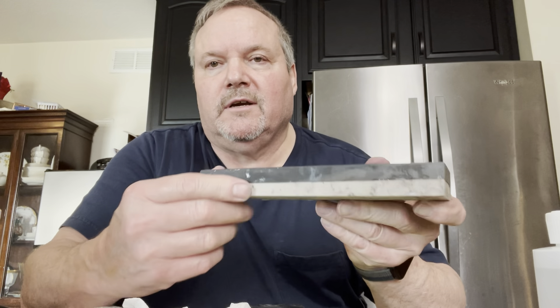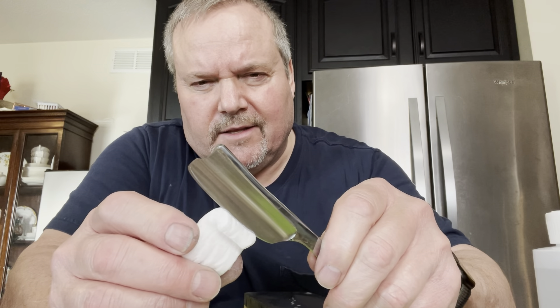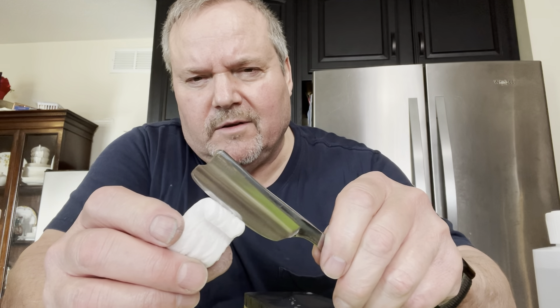This is a soft arc, hard arc, long radius, short radius. I've worked back and forth a little bit with this and I think I have a much more refined edge. I'm not getting the push cut right now — I want a little bit of lateral movement and it does that, so it's getting really, really close. I went from the sharpening supplies synthetic stones to the Naniwa 12K — I was just not totally happy with that. This Arkansas is certainly a little bit better.